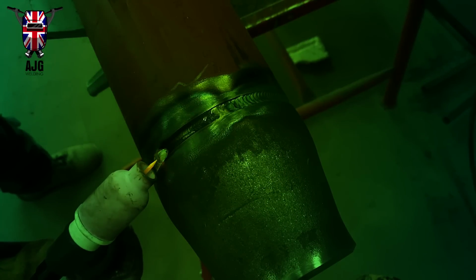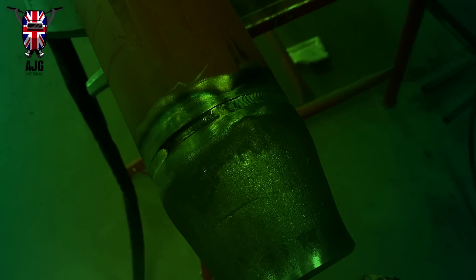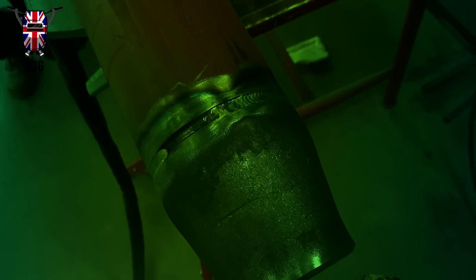You might also find if you're using a 2.4 filler wire, where you're adding more material, it won't come out looking as clean, but it's still going to be fine because you're going to be cleaning it off. It's not going to be contaminated as long as you ain't dipped your tungsten. It's just not going to look shiny, if that makes sense.